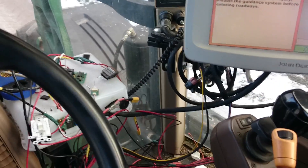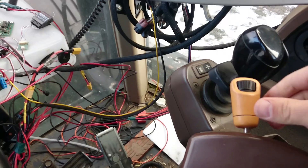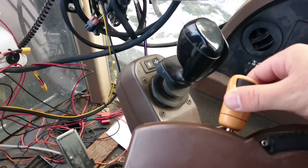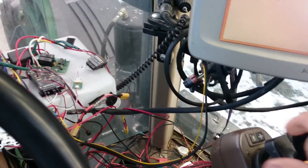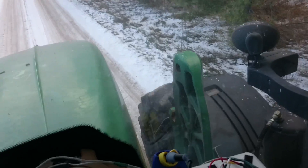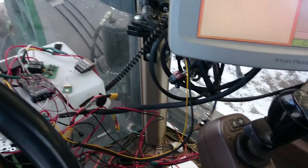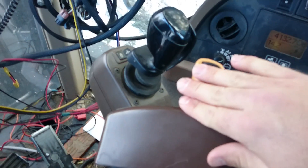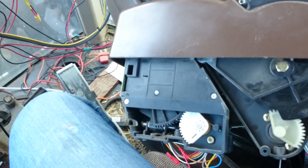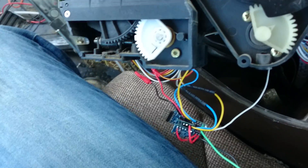Now if I release the safety pin, even with the lever in the full forward position, the tractor is still just creeping forward. In order to reset it, the lever has to be pulled all the way back and now I'm in control again. The reason for this is that once the tractor is working autonomously in the field, in order to make it work autonomously, this lever has to be at the full backward position. It has to get the secondary input that tells it it can go, and then it can go. The code is up on GitHub for that one too.